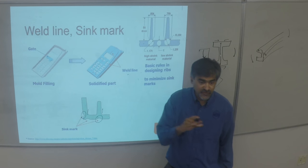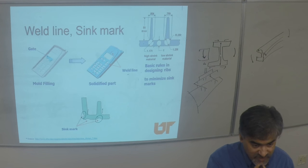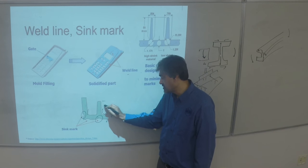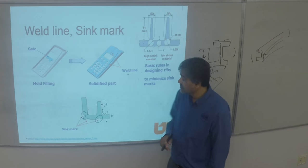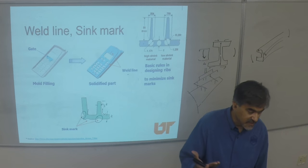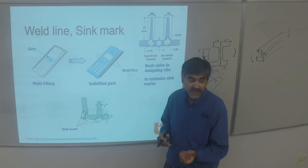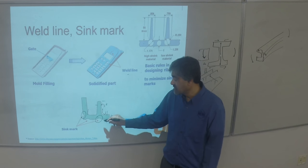If you see badly made toys, you can see there's always some pulling of the material at those locations. That happens for two reasons — geometry and processing. Typically if the base is T thick, the rule of thumb is the rib should be about 3T tall. Infant seats are a good example — on the back they're highly gridded with lots of deep thin ribs. To avoid sink marks, the base is made slightly thicker in those cases.